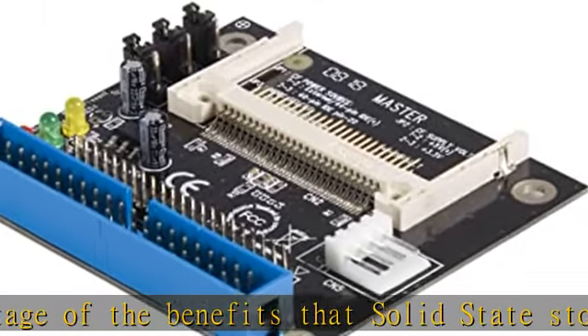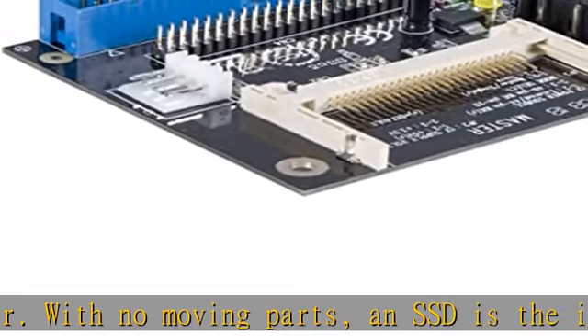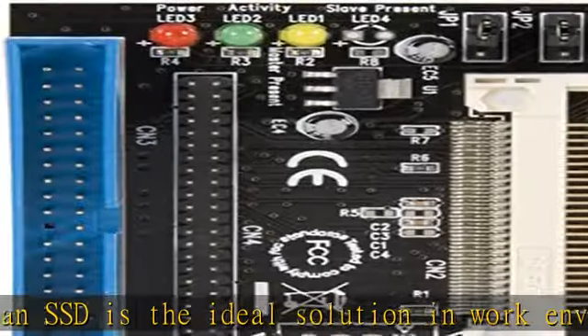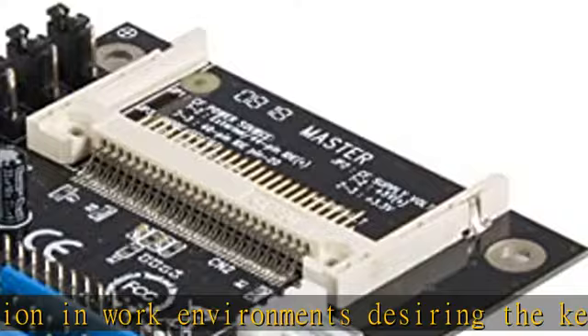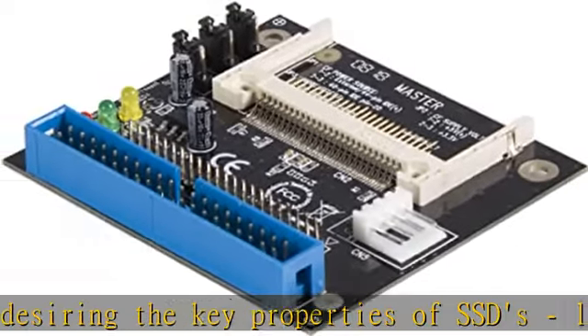The adapter is equipped with both a 40-pin 3.5-inch desktop HDD IDE channel and a 44-pin 2.5-inch notebook HDD IDE channel. This unique multi-interface board allows the adapter to be used in both regular and small form factor case designs, creating a perfect solution for embedded systems.